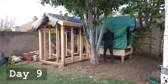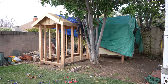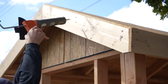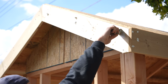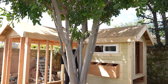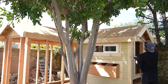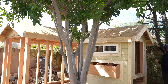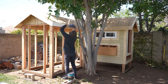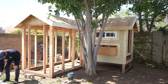The rain cleared up, so I pulled off the tarps and got back to work. It hardly ever rains here, but there was more rain coming up soon. So instead of painting the entire structure, I switched gears and focused on finishing the roof. I caulked all the seams, screw heads, and knot holes in the trim around the roof. This needs to be painted before adding the roof flashing so it's protected, so after waiting 30 minutes for the caulking to cure, I rolled the trim with ultra pure white paint with a satin finish, the same as the workshop.